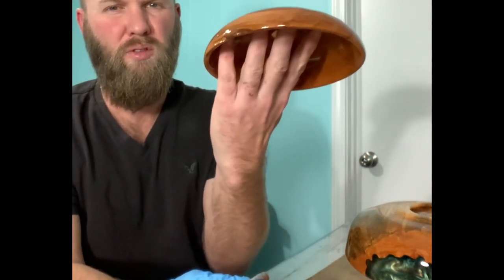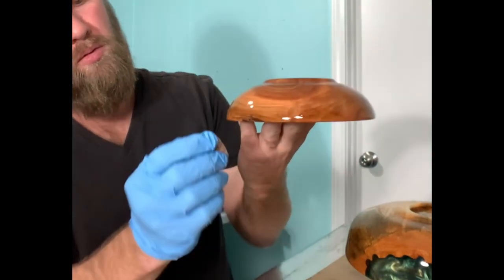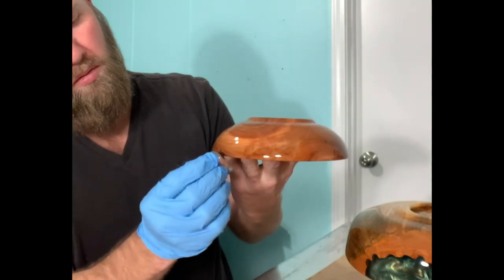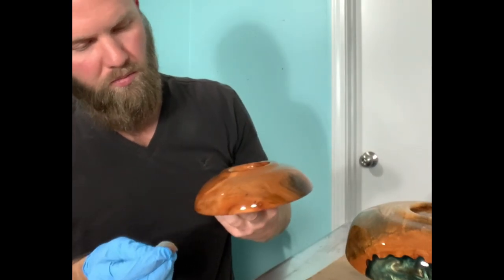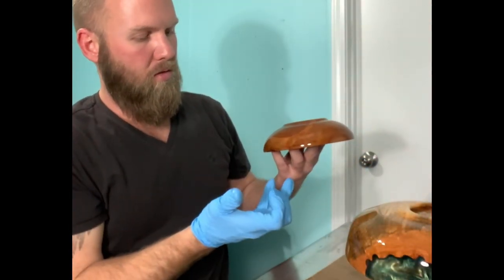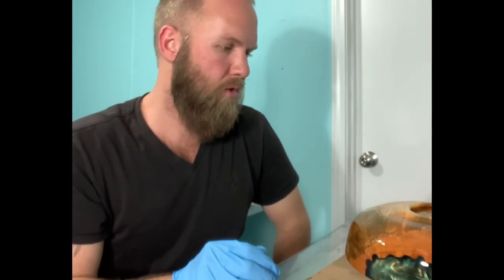I figured I'd leave a little bit of the character — this one had a few wormholes in it, so I left some of that on there to give it character. Once you put this finish on there, it'll harden up. The other thing about this stuff too: if your wood is really punky, saturate it with this stuff. It hardens the wood. It'll also build you a nice little base coat, saturating the punky wood. Just pour it on, let it drink all it wants, let it sit for a few days and return to it. No tear-out, no chunks missing.